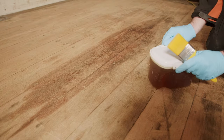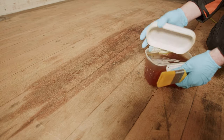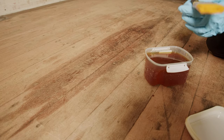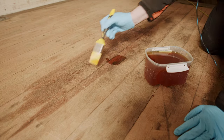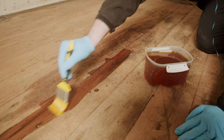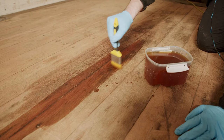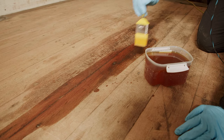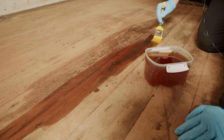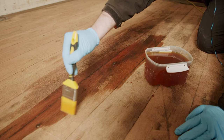The truck isn't worth spending the extra money on when we have the watermill to focus on. Varnish would not apply directly to the stains, however, as it just won't cure in contact with hydraulic fluid. Therefore, I'm coating the deck with shellac first. I'm making the shellac sealer myself from flakes and isopropanol, then using an ultrasonic cleaner to take the mix time from 24 hours down to under an hour. Making shellac myself from flakes saves money, as long as you buy flakes without a fancy logo on the package. I'm specifically using de-wax shellac to ensure my yacht varnish will adhere well to it.